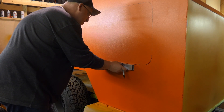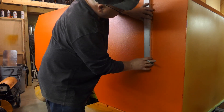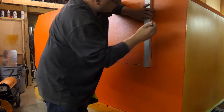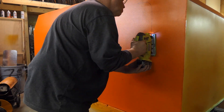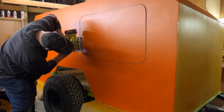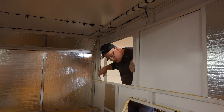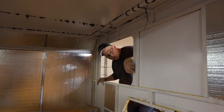When I installed windows in the van, I made sure to cut on the inside of the line, because you can always go bigger — you can never go smaller. The window opening is a little big on each side, so we need to put some wood at least an inch and a half away from the opening so that the blinds have something to screw to. The rest will be insulation.